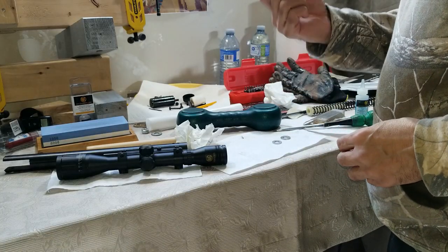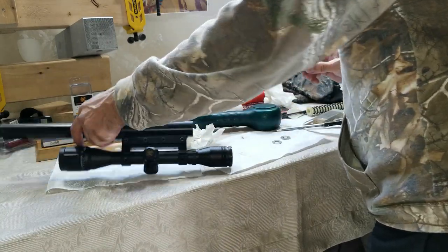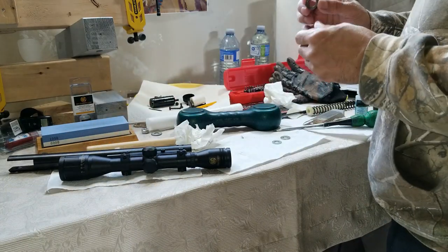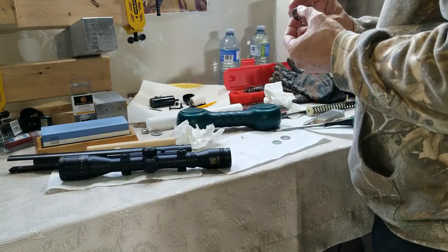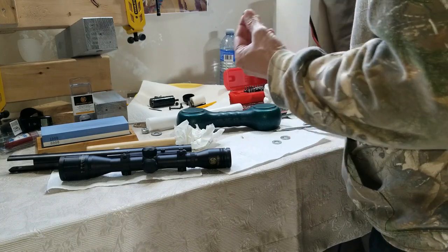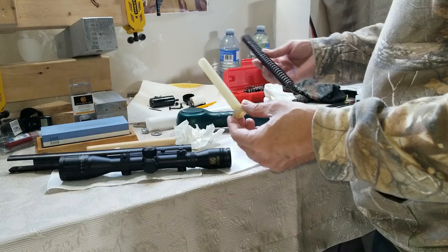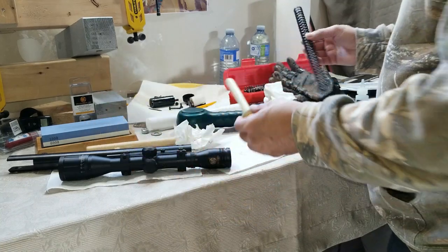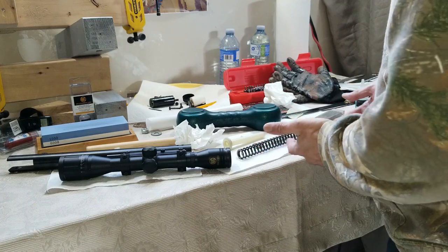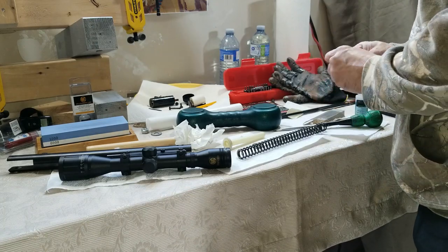This is a little bit of weight that I'm gonna put in front of the piston — it will go inside there. Because I'm using slightly heavier pellets, this will prevent the piston from bouncing. This is what I'm gonna use for that, and this is the piston. Now the next step is to put it all together.